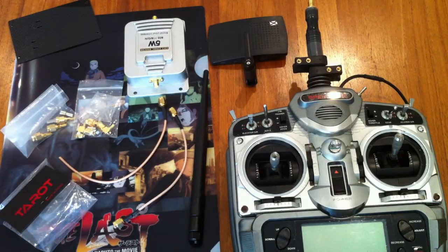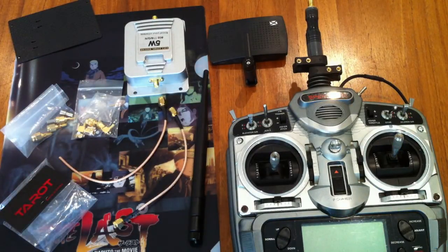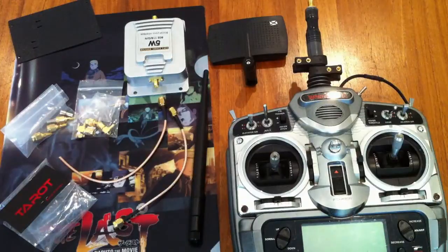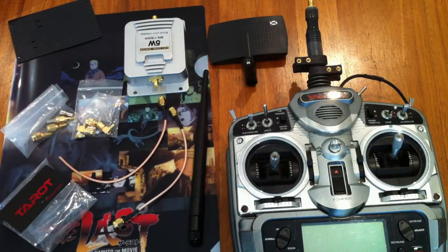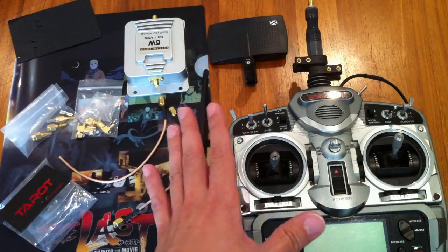To do this modification, you're going to need a few items. The first item would be a 2.4GHz WiFi signal booster like this one. You could get such a signal booster on eBay for about 70 USD. This is a 5W booster, but when I tested the output it's actually closer to 3.5W — it's an overrated product from China. But it does work really well in increasing the range, and it is compatible with the FrSky transmission and the DSM2 transmission, or similar types of spread spectrum radio waves. So it's going to work for most radio control systems.